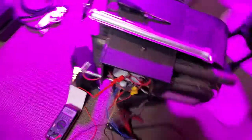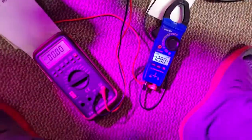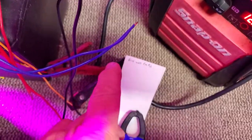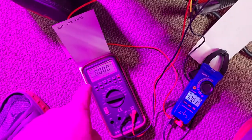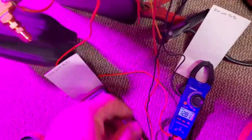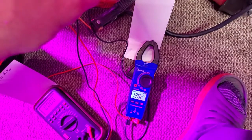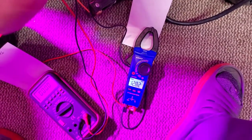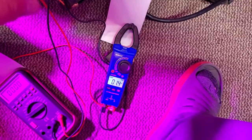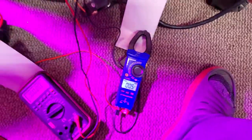What you're seeing is she went into lockout three times and it said turn the fan off. The thermostat's still engaged, so you're still going to have 12 volts coming out. The fan switch opened, breaking the circuit. Now watch — I'll take the 12 volts away, reset the thermostat, turn it off, turn it back on, and you lose 12 volts. This is how that circuit works when it works normal.